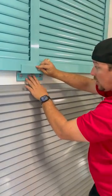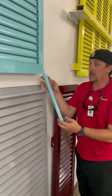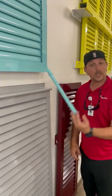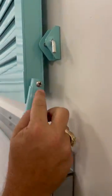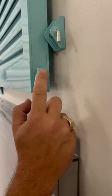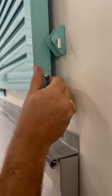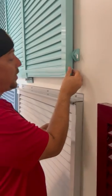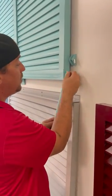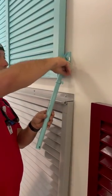Once you have those installed properly and they're sitting tight against the shutter, the next thing we want to do is remove these arms. Last thing you want is this beating around during a storm. If you come around the side over here, you can see there's a bolt right in this arm. This bolt right here is a Phillips head number three — use a screwdriver. You're going to back that bolt out with the screwdriver all the way out, removing it from the side of the Bahama.